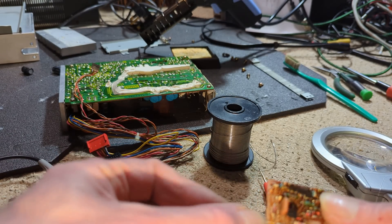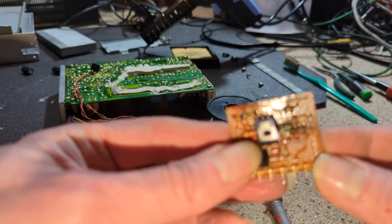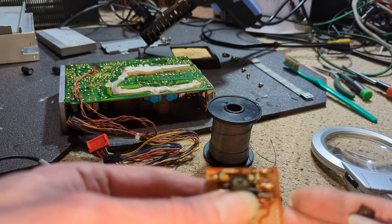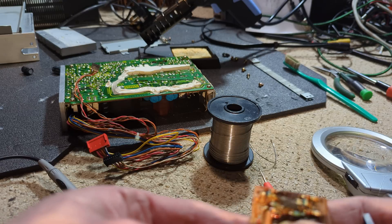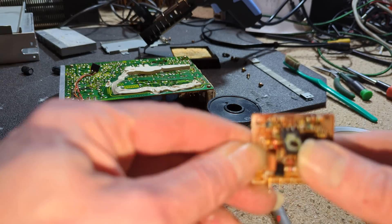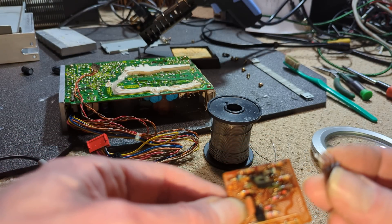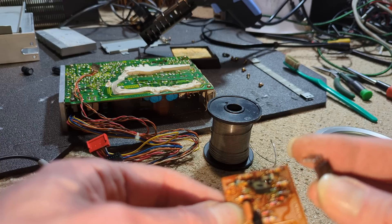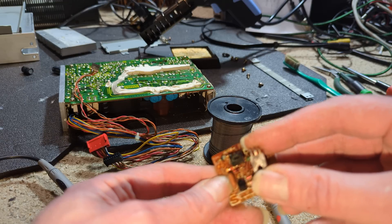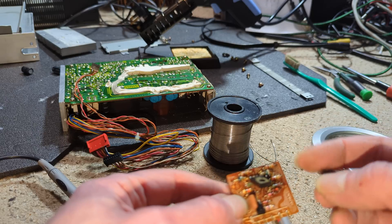It's got pretty hot in here, I think. The whole power supply seems to have got quite hot. But I did test the two large transistors - I checked that one as well - they all checked fine. This one's a standard transistor, a BJT. There's a diode across it, so it was testing as having a diode drop both ways across the outer two legs. But that's absolutely fine.